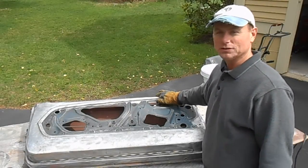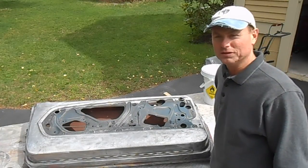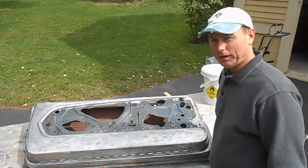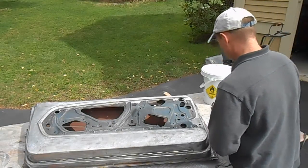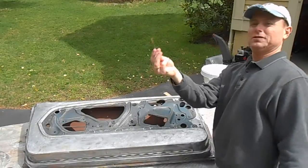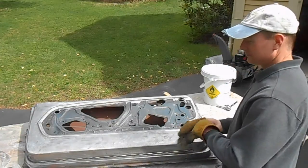So I just have to take out this bolt, and then pretty much the door skin will come off, except down here at this lower corner where it's kind of all welded onto the door. And then we'll cut it off and clean that area up. So let me get this bolt out. Now the bolt is out. Skin should come off.